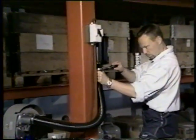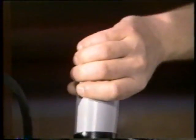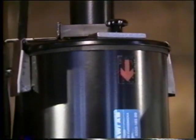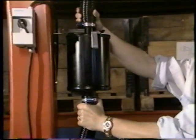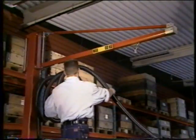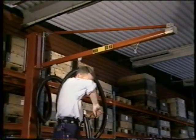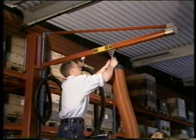Section 1 of the air hose is fitted between the pump and the air filter. Hose clamps should be used. VM 100 and 120 come with a reducing socket, which is placed inside the filter inlet. The filter inlet and outlet are marked with an arrow. The filter should be fitted where it is easy to reach. The lifting hose is fitted with the top swivel directly under the trolley in the crane system.